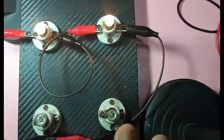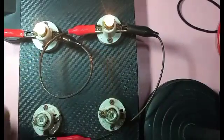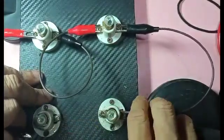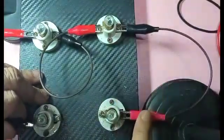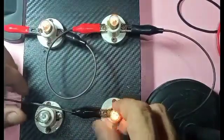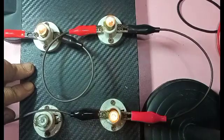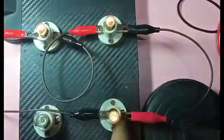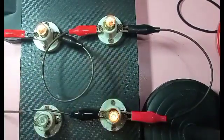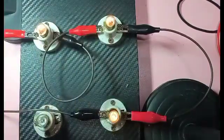As you can see, their luminance is quite bright, since each bulb gets 2 volts. Let's try to add another bulb to see what happens to the brightness of these lamps. Connecting the third bulb — negative, positive — going to the negative terminal of the battery. As you can see, they're quite dimmer than before, since now 4 volts is being shared by 3 lamps. Before, 2 lamps shared 4 volts, so each got 2 volts. Now it's less since there are 3 lamps sharing the 4-volt source.